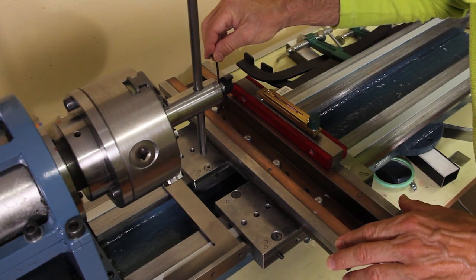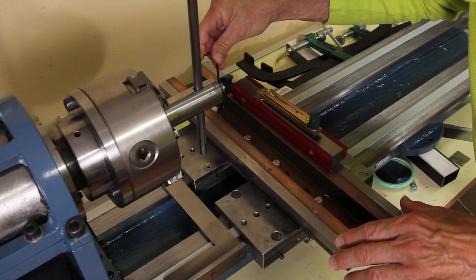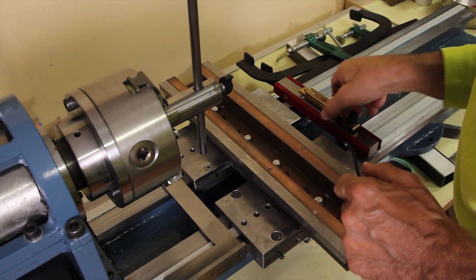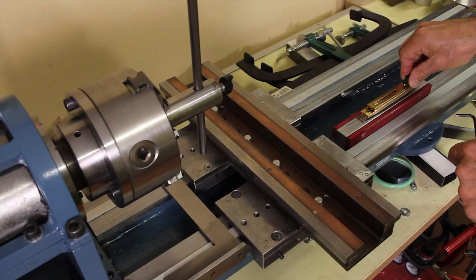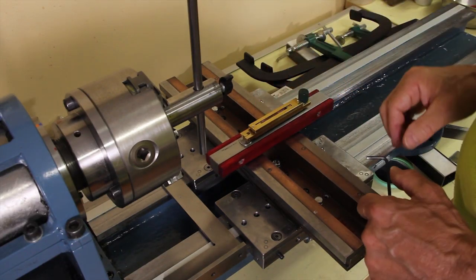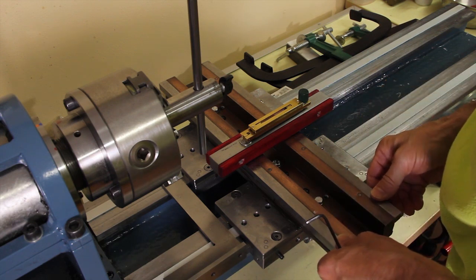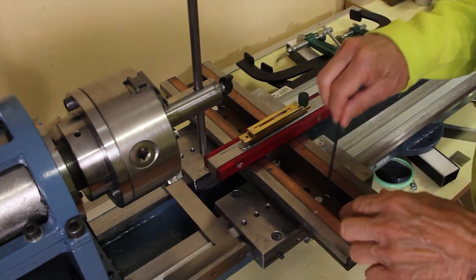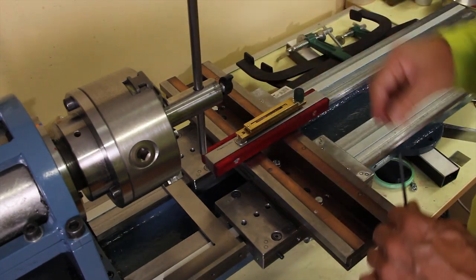This is the delicate moment — the sensitive phase in which the cross slides have to be aligned and leveled against the sleds that will form the carriage. For this tricky task I've used my machinist level that I made myself — link to the video in the description down below. This task requires a lot of care and took a lot of time to be completed.